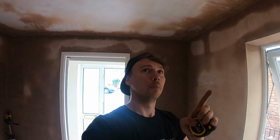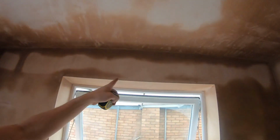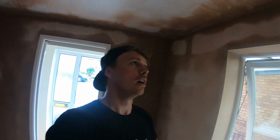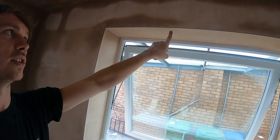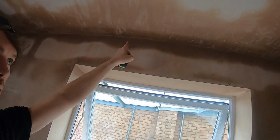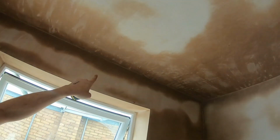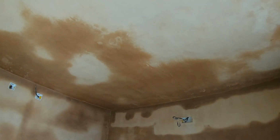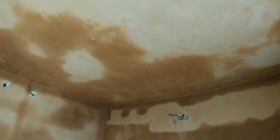So I'm going to pop up, give it a measurement from this wall to here, from the loft hatch. Then I'm going to get a measurement from there to there, so I can do it in one go. Obviously this is a finished wall, so there's at least 1.5 inches on this wall here from what there would be bare brick in the loft. So get that measurement, add a little bit, see roughly where we are. And of course, the joist is literally directly on the centre there, which is fantastic. So that's just going to be bumped in 60mm, and then I'll have to duplicate that so it makes it symmetrical each side.